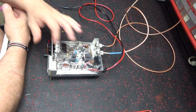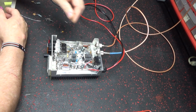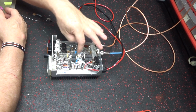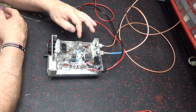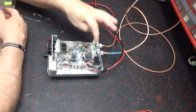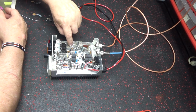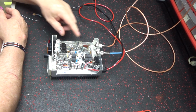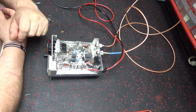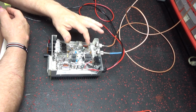I put this wire on here. That was this little shit here, and I put Teflon wire there. 2 new 10 ohms, 2 new flybacks, 1 new transistor. This 1000 cap. Grounded this from here to here. Grounded this from here to here. Then blow them traces out. Got it back up and working. Cleaned the board out. Put a new cap here.